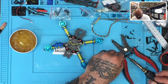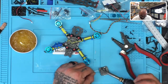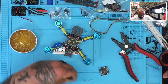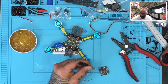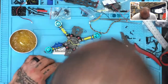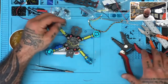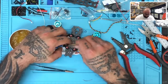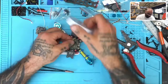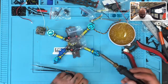I'll tin up the TX6 pad. This TX is going to go to the smart audio, so the wire goes from the TX on the underside of the flight controller to the smart audio pad on the VTX. Let me tin that pad quickly. I'll cut the wire to size — it's going to fit right here, feed it to about right there, trim it down a little, strip a little bit back, and tin it up. If you're soldering over the board, make sure to put something underneath so you don't drop solder directly on it — I'll use this plastic bag.